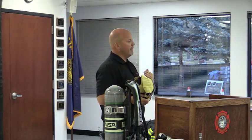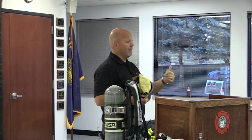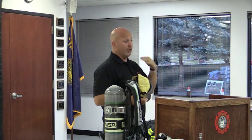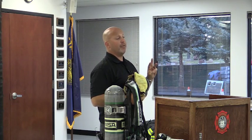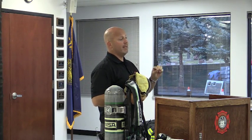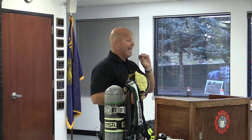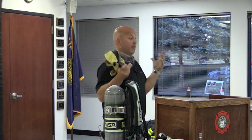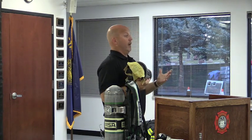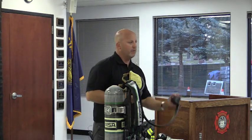You'll note when you first put on the SCBA, it'll amplify your inhalation and your exhalation, your breath in and your breath out. It learns, the SCBA learns, what your breath in sounds like after about 3 breaths. Then what it does is it mutes the inhalation sound. So all you're hearing is the exhaled sound, which can be you breathing, your exhaled air, or what? You talking. When do you talk? You talk on your exhale, not on your inhale, right? You talk when you're blowing out, shall we call it, okay? So that's the way it's designed to work.